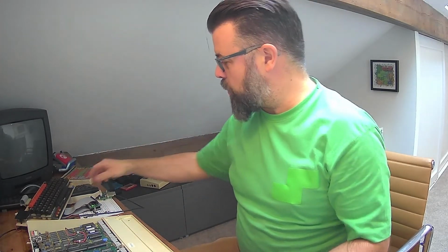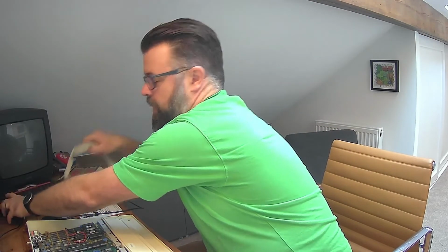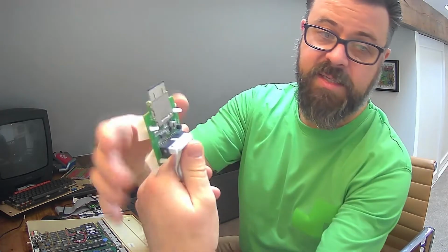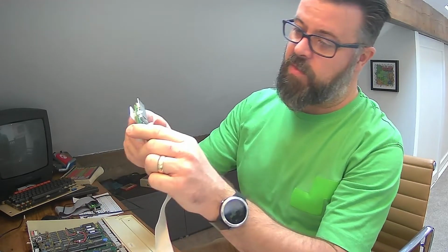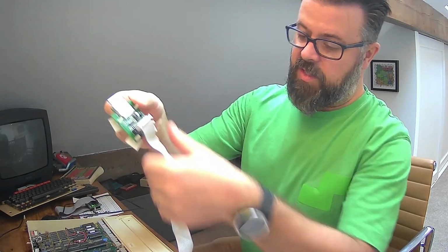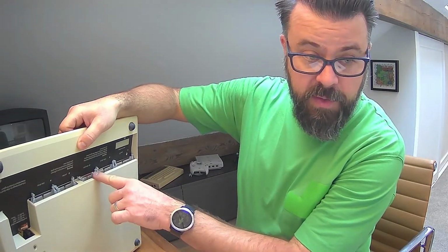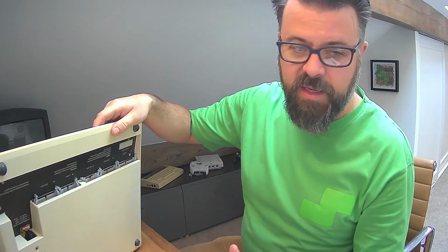Yeah, so I've got two upgrades for it. Like I said, that ROM chip in there enables this thing to work, and this plugs in. You can see there's an SD card slotted in the top, just a little printed circuit board. It says BBC Micro MMC interface, which matches where it says MMC on that chip in there. Then this ribbon cable plugs into the user port here. I won't plug it in yet because I want to screw all this back together and show it to you.